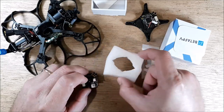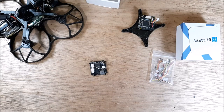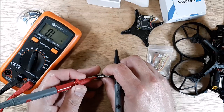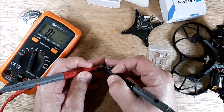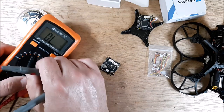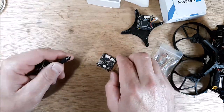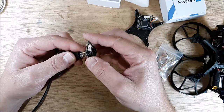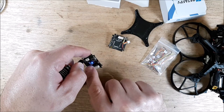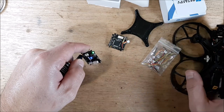Here's the new flight controller. I'm going to do a continuity check on this — I don't want to plug it into my computer and have any issues. The VBAT and the ground pad are labeled right on the flight controller. I'll go to VBAT and ground, touch those two pins — nothing. I feel confident we don't have any nasty surprises when we plug it into our computer. Plugging in, the LED came on. On this one, we have a green blinking LED, which we did not have on the bad one — that one only had a solid blue LED in the center. That's also an indicator that our flight controller is the reason this thing fell out of the air.